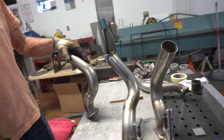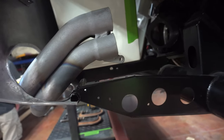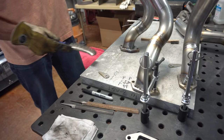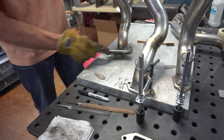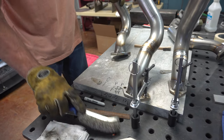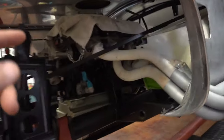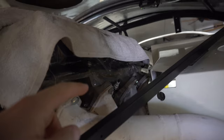I've got to add the little tabs to tie on to the headers — or the collector, I guess you could say. So everything's built there. Does this have little gaskets or do you just silicone it or something? Who knows what they want. They didn't bring me nothing, so they might put something — we're going to have to cut some paper gaskets. I'll figure it out. But otherwise that'll be one side done, and then he can move on to the other side. So I'm sure I'll be back to work on that one. That back tube's going to be a heck of a pain to build right there.